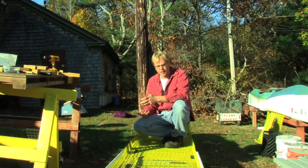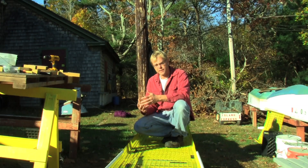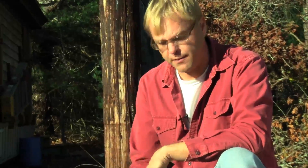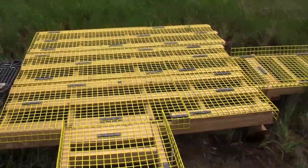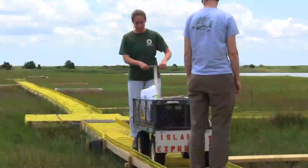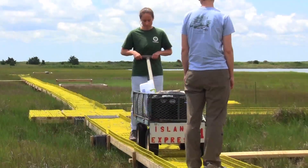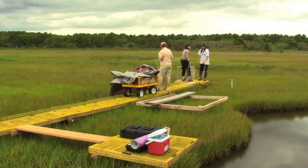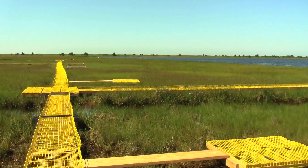The main thing we like about this design is it's modular. We can build a 12-foot piece, a 4-foot piece, or an 8-foot piece. We do have to deal with turning points, so we've built 6x6-foot frame turning points using the same decking material on top to make 90-degree angles with our carts. We're able to easily add on additional panels off the side and make turns to get researchers to other parts of the marsh.